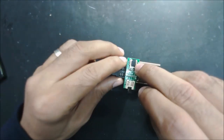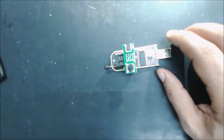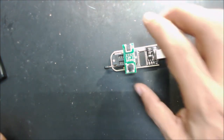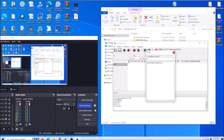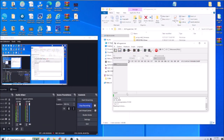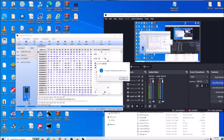Usually the 16 megabyte chip is on this side, and the 32 megabyte is on this side. So we are going to read it and save a copy. I've done reading the chip with one program and verified it with another program — I can be 100% sure the copy saved on the computer is 100% matching the one inside the chip.